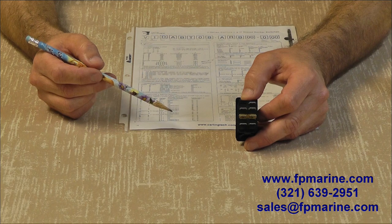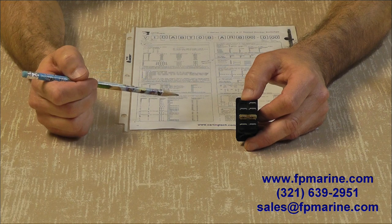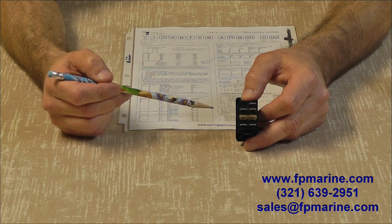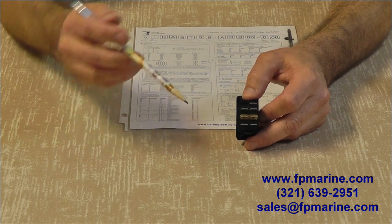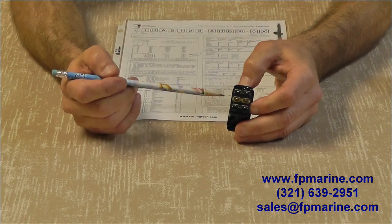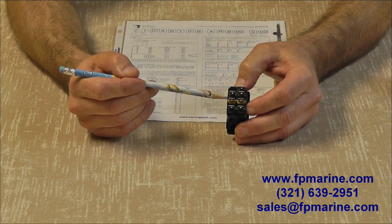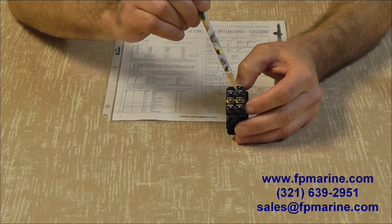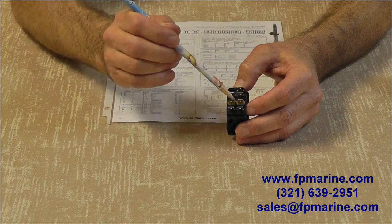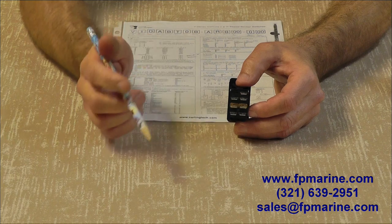The way to wire a nav light switch: in one position you want your bow light on and your anchor light or stern light. In the other position you want just your anchor light on when you're at rest. So let's say we want all the lights to come on in position number one — these two terminals and these two terminals are going to be connected. We'll run our anchor light off this one and our bow light off this one. In the middle position, off — nothing is lit.